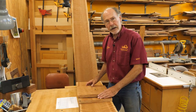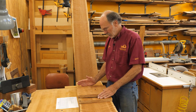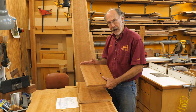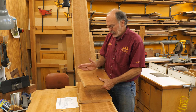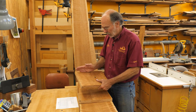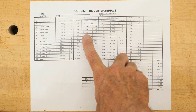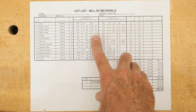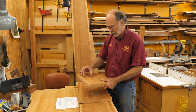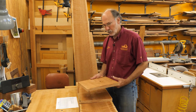That didn't work out quite as well as I had hoped — I had to take more off the end of the board than I expected. I cleared the end to where I thought I had good intact material, but I didn't want to just cut the crack off because I would have had such a short piece. So I went over the amount I needed for my side aprons, which finish out at 10 and a quarter. I cut the board at about 11 and a quarter to 11 and a half, so I can get my two side aprons from what would have been an off-cut.